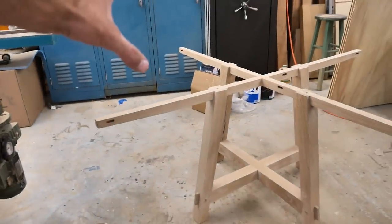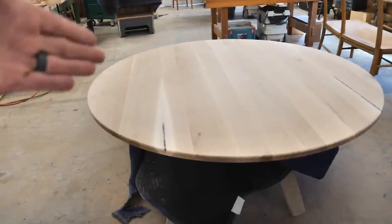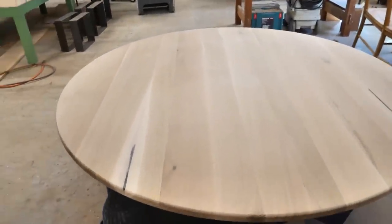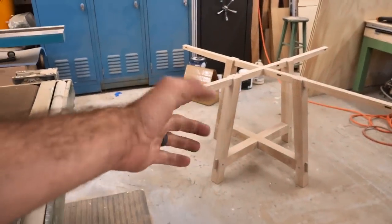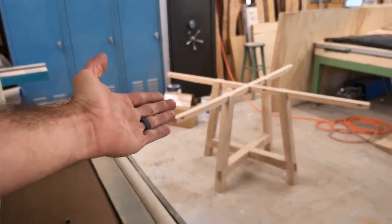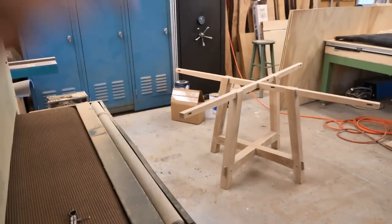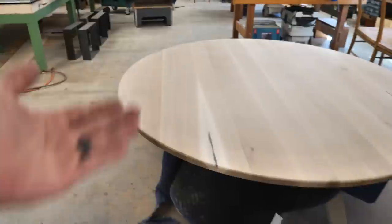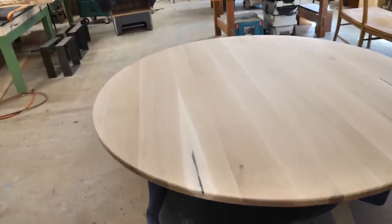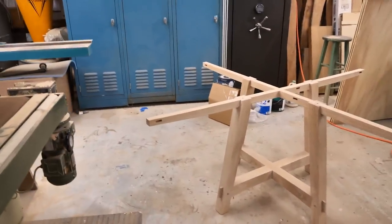The through tenons are a really cool touch. Right now for finish we're going to put a sealer on this probably this afternoon, and same with the tabletop — it's got a round tabletop and it'll get a sealer as well. Then we'll put a clear coat of conversion varnish, a very durable finish that'll hold up well as a dining room table. I didn't do a full build video on this — this is the McCurley table, a little different design variation. I'll link in the description both that build video and my website where you can order this table.